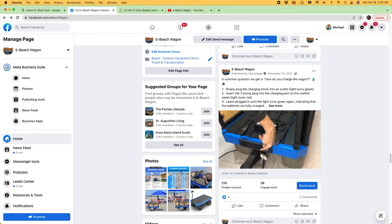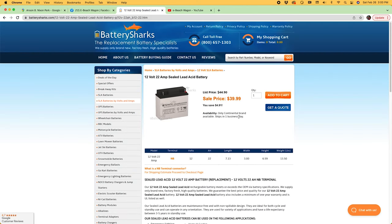We recommend that you charge after every use to improve the longevity of your batteries. There are two 12-volt, 22 amp-hour sealed lead acid batteries on the wagon. Sealed lead acid batteries are great because they present a low fire risk and are not considered a hazardous material when shipping. Plus, they are readily available, low cost, and easy to replace. You can buy one battery for about $40, so you can replace both batteries for about $100 including shipping. These batteries should last about five years if you keep them charged properly.